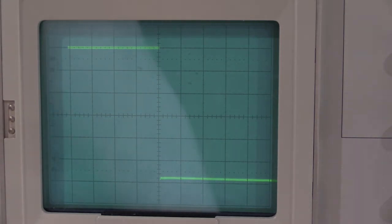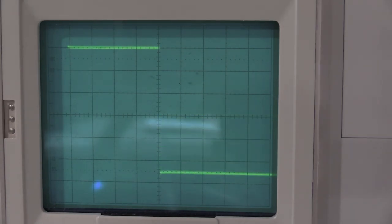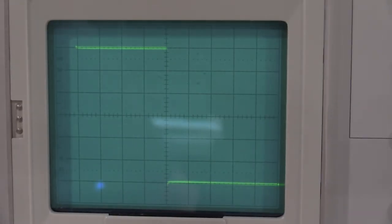All right, 20 millivolts, we're doing C106, 107. That needs a little bit of adjustment. At the very corner, sorry about bumping the camera. At the very corner, it's sweeping up like this, so that we want to compensate out. 106, 107, those are all the way in the back. Now this bottom one is right at the corner there, so I'll get that adjusted. The top is if you have some major tilt.